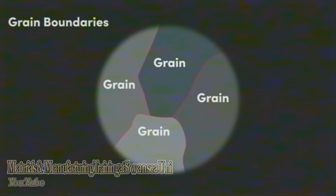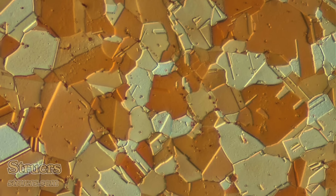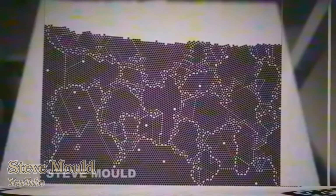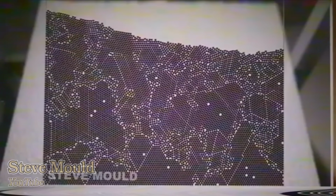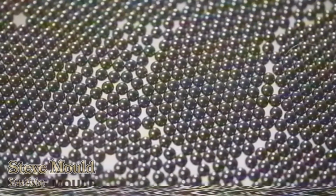How metals behave is heavily dependent on grain structure. Big grains mean big bends. Bigger grains mean a more malleable crystal structure, and smaller ones mean the exact opposite. So even if a material is chemically the same, the way it's structured on a microscopic scale can give it subtle changes in performance. Since we're talking about a scale of atoms, stuff like heat and work can change how grains are arranged. Heat treatment does this by exciting the molecules with heat to make them jimmy into new positions, like aligning the crystal structures of the grain together. Work hardening rearranges the grain boundaries to make the metal harder through mechanical alignment. In simpler words, the grains get physically rearranged by work, and that makes the metal harder.